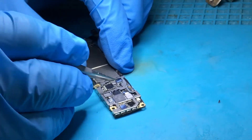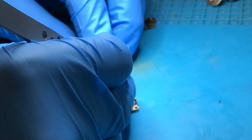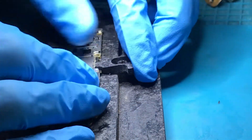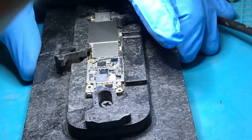What I'm going to do to start off with — there's a bit of metal here in the way of Tigris, so I'll always peel that up first and then cut it later once it's all tested, or push it back down if needs be. First things first, get it on our preheater. You don't really have to use a preheater for such a standard repair as a TriStar, but it's good practice, so I'll make sure I'm always using these.